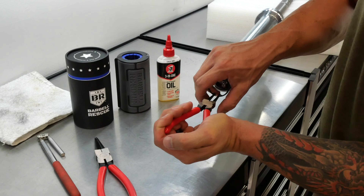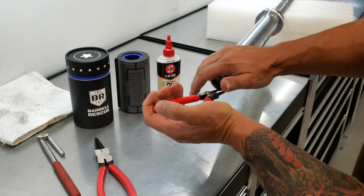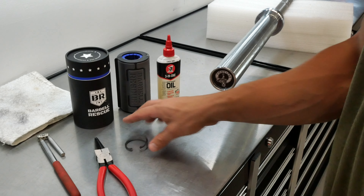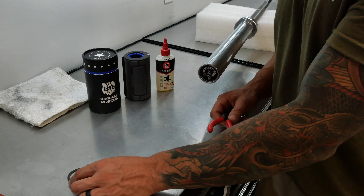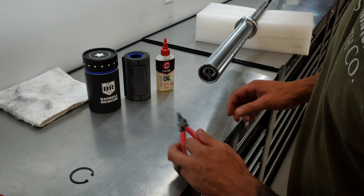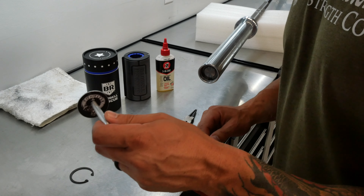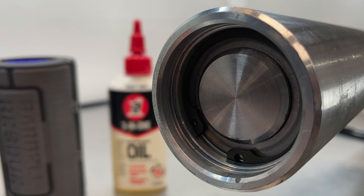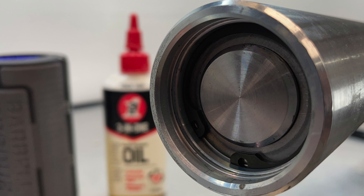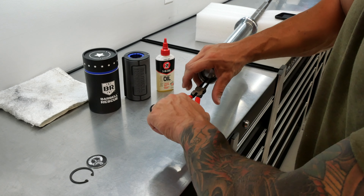The first tool that you're going to need is a pair of snap ring pliers. In here, you've got a snap ring and then your end cap. These snap rings are under a little bit of pressure. This is actually going to use a smaller size snap ring plier. There are different types — some pull the snap ring together and some expand it, depending on if it's an internal or external snap ring. You want to just cover it and pull it out carefully. Remember, this is under tension, so you don't want it to fly anywhere. Got the first snap ring out.